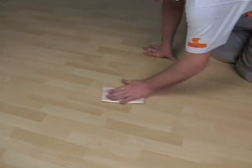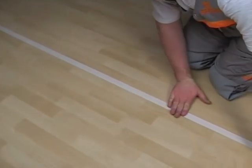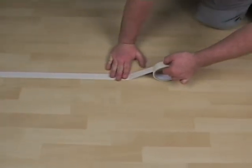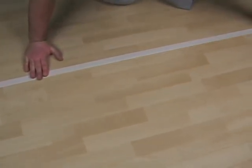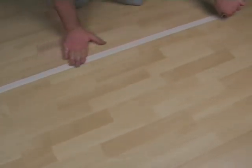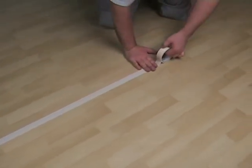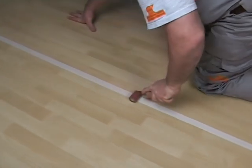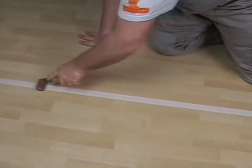The seam area must be clean and dry for professional cold welding. A special masking tape which is resistant to the cold welding liquid has to be fixed evenly centered over the closely cut seam. It is absolutely vital to avoid damage to the outer floor finish coating, for instance made of polyurethane. Apply the masking tape tightly by using a seam roller to prevent the cold welding liquid from penetrating underneath the tape.